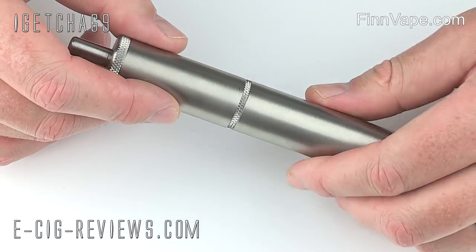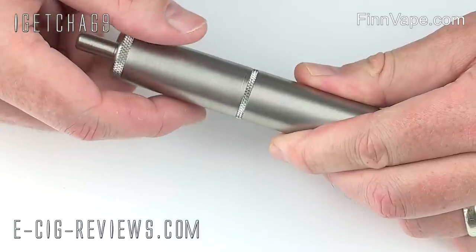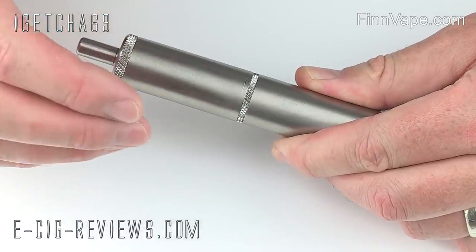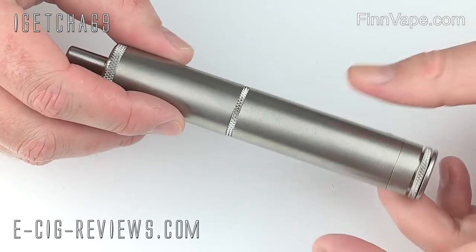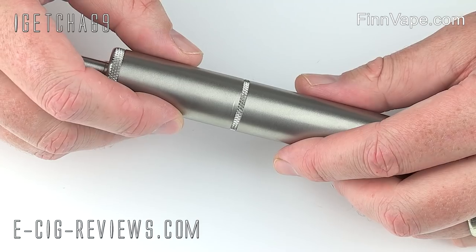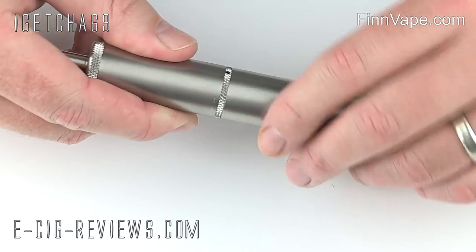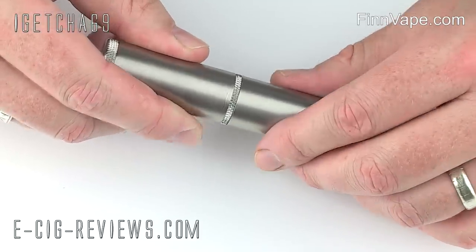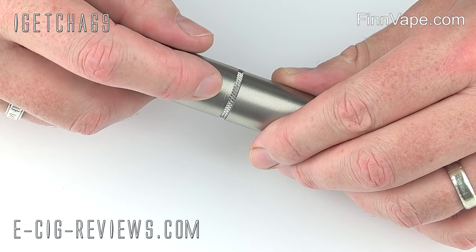There were little sort of splinters of metal. It's been there quite a few times now where I've gone to either unscrew something or screw a part on, and the parts have just pretty much all locked together because there's a little bit of swarf caught in between the threads, making it really difficult to unscrew. On a couple of occasions I've had to get a set of pipe grips out and grab hold of the body to get enough purchase to undo them. Unfortunately I did slip on one occasion and gave it a rather nasty scratch.